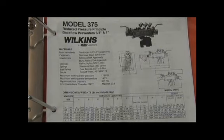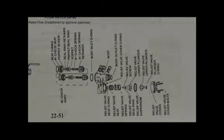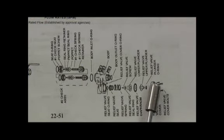So the check and relief valve are one piece. The chassis stays in place as this whole vessel comes out from the top and then can be rebuilt outside of that chassis. The chassis stays in the body. Here's a close-up showing that check mechanism, that vessel here that comes out through the center. Check assemblies slide through here, relief valve mounts through.